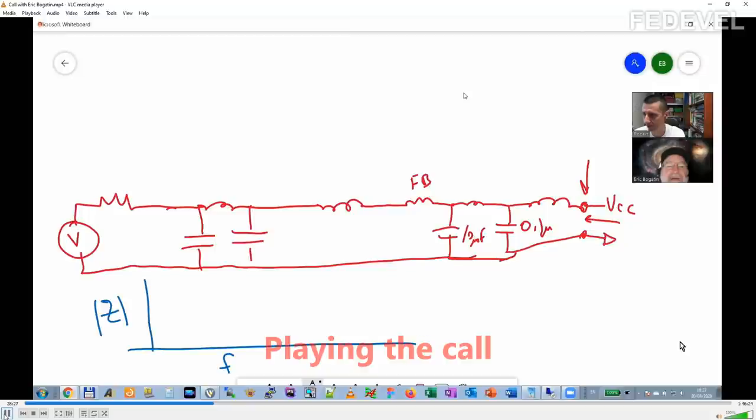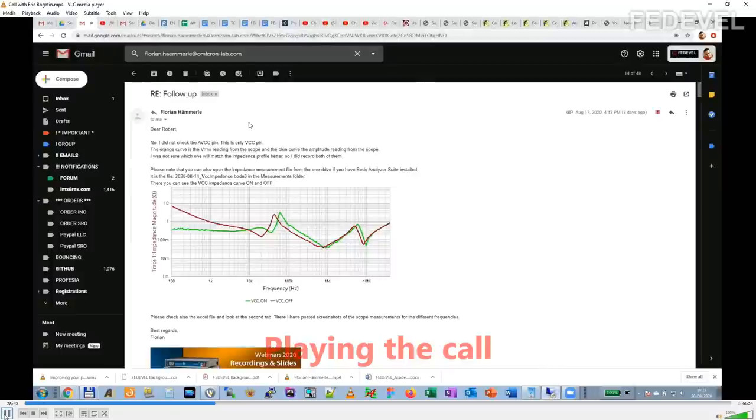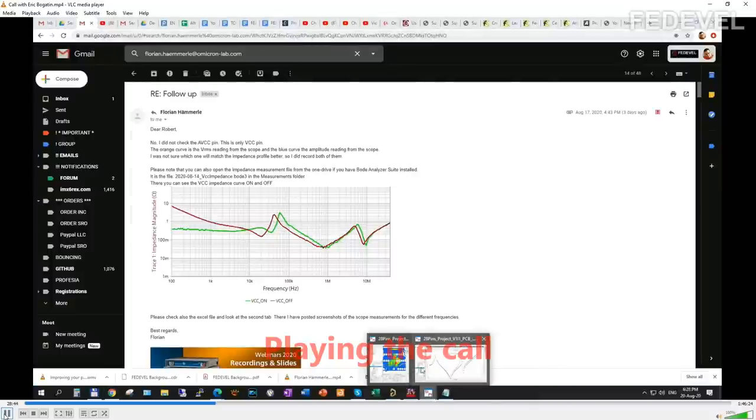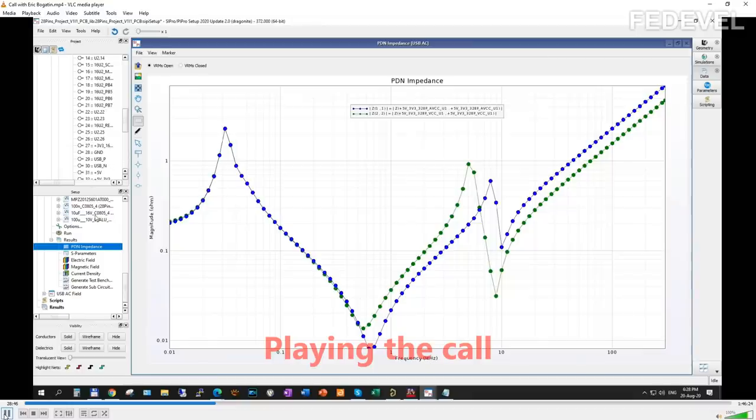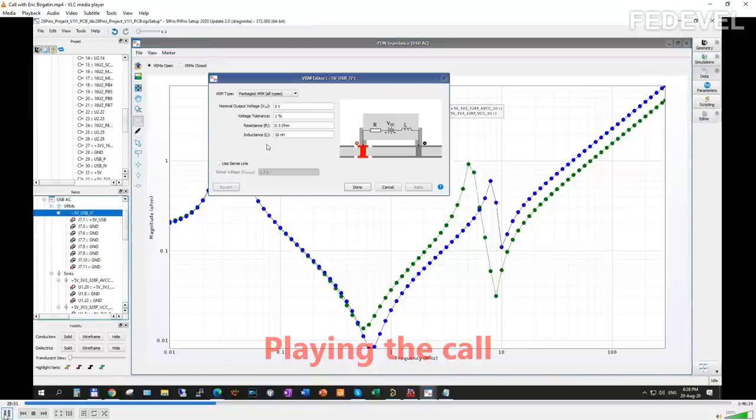Just the resistance of all the inductors and all the wires. Yeah, and we're going to compare to your simulation first. In your simulation, didn't you put a value in for that resistor? Was that 3 ohms or 0.3 ohms? I'm going to double check. I put 0.5 ohm there. Okay, so that's going to be 0.5 ohms starting out at low frequency.